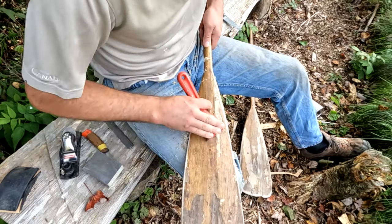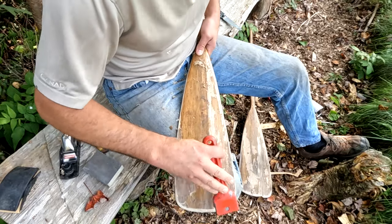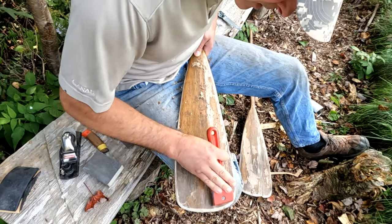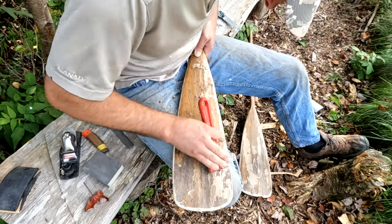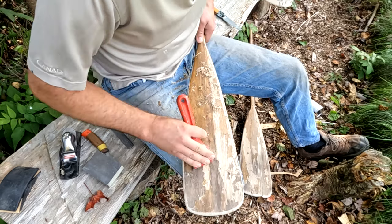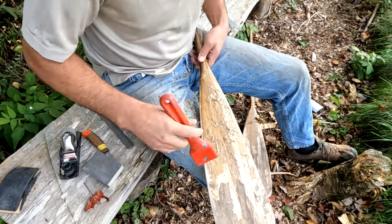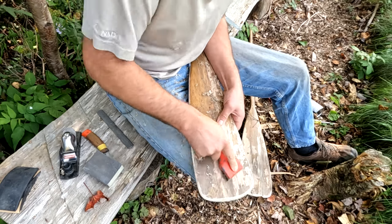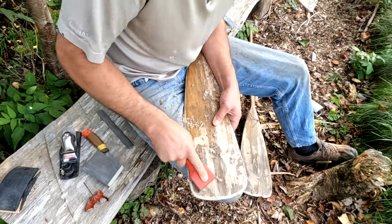But when I varnish this, the stuff that's not coming off is just going to get sort of re-glued in. And remember, most paints have a kind of gluing effect. And of course, everything that's bare will get recoated. You can see this is not taking long. And this is partly helped by the fact that the scraper I'm using is really sharp, right?